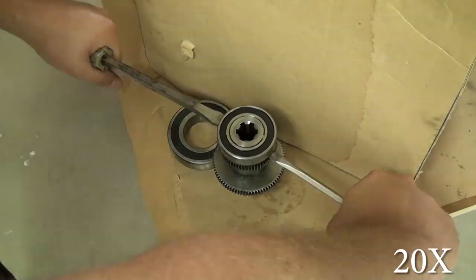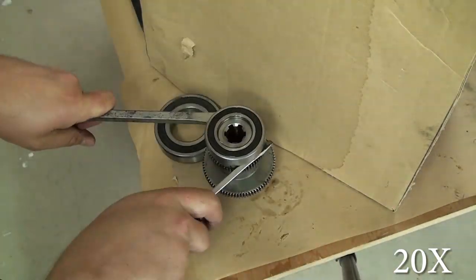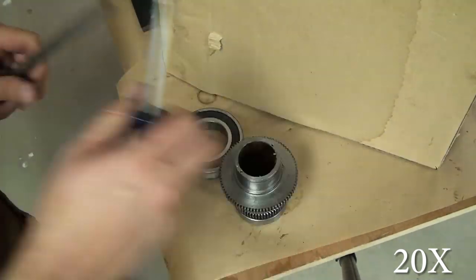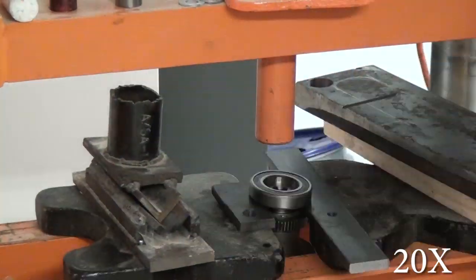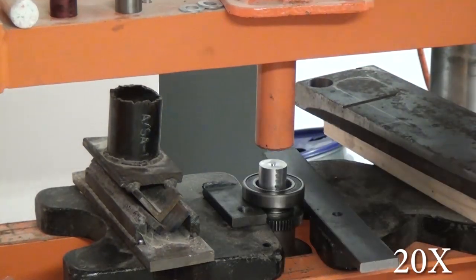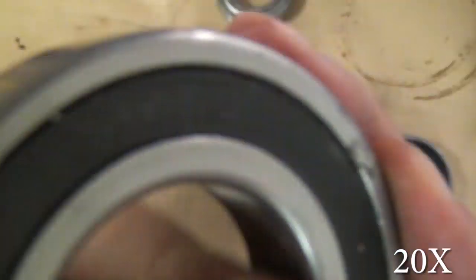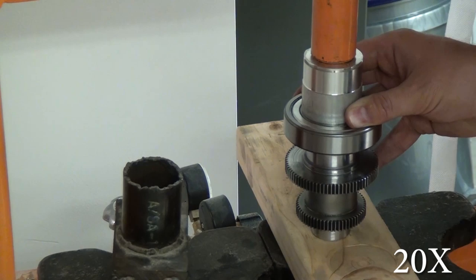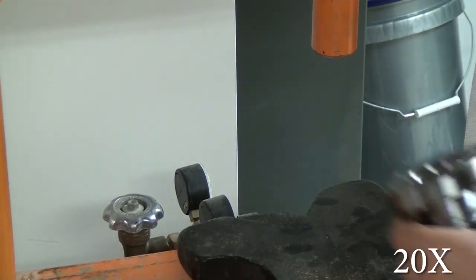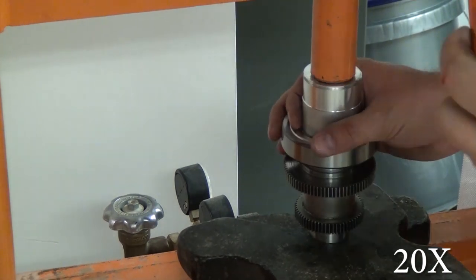The rest of this is just about whatever process works to get the bearings removed. I used two screwdrivers to pry the bearing up high enough to get some metal under it, then took it back to the press and got some bars between the bearing and the quill to press the bearings out the rest of the way. It's kind of a pain but nothing you shouldn't be able to handle.